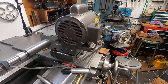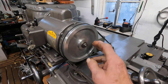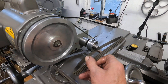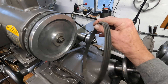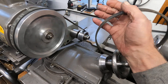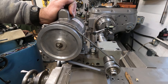Here's my grinder — it's got a 3,450 RPM half-horse Baldor single-phase motor on it. I make these flat pulleys to run true, and I make the belts myself out of micro-groove belts. I can set this and another motor up on the bench, run them at a speed that sands the grooves off. These are extremely low cost and extremely available — I don't have to wait or order anything. I can fab one of these belts out in an hour and then it lasts for years.